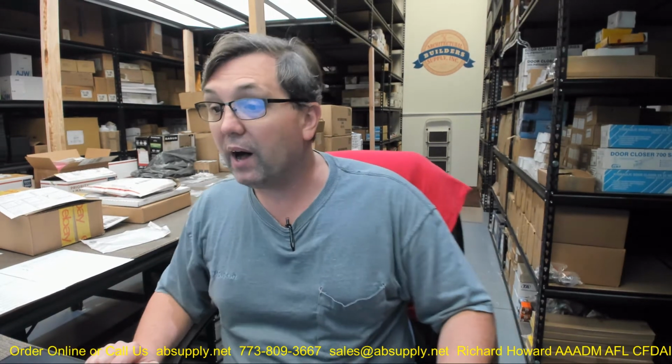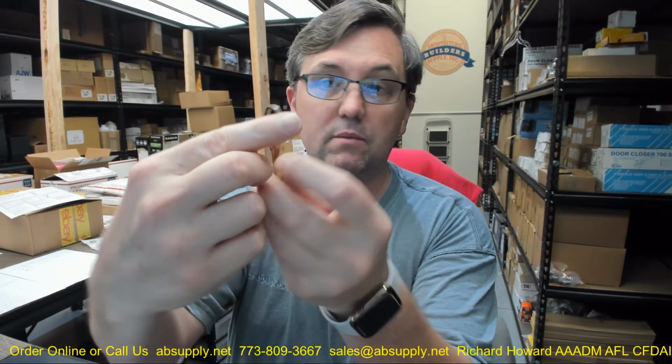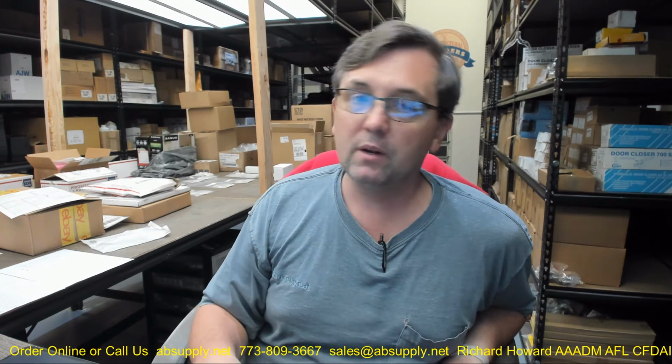Now, why is that important? Well, you see how that's blank on this side, and that's got Schlage on the other? You might want it blank on both sides. Also, with blank on both sides, which they call plain, 35-015, that will say on there, do not duplicate as well. That's called visual key control. That won't stop anyone as a possibility of violating an agreement with the manufacturer of cutting those keys. But if you walk up to a lot of locksmiths, they'll say, no, I'm not going to cut that key because I can't be sure that you own the lock that this goes to. And just out of the morals and ethics of the profession of locksmiths, they'll just politely refuse to copy that key. So you can see there for your C family how you've got those two possibilities.